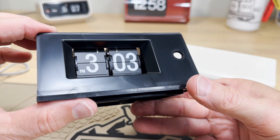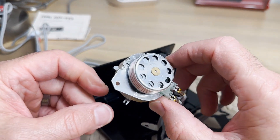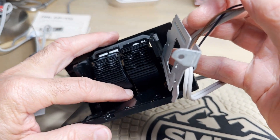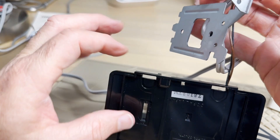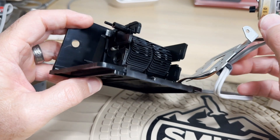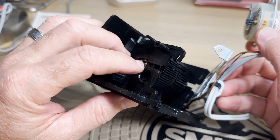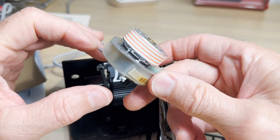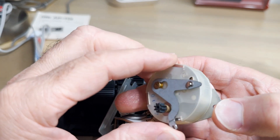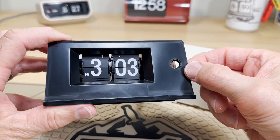Just wanted to break in here — we talked about how this clock switches from 50 to 60 hertz operation. The back just came loose and came right off. You can see where the hour hold-back comes down through here into the bottom. Normally I've seen a supplemental separate gear train for frequency switching, but in this case they used the gear inside the gearbox itself — the gear train switches inside the gearbox for 50 to 60 hertz operation.